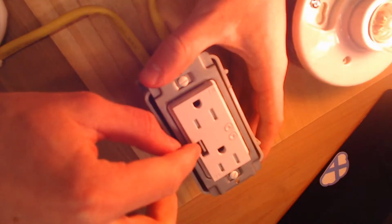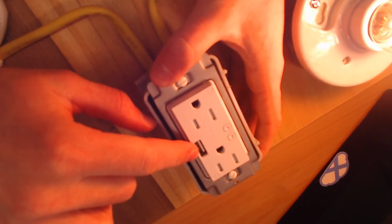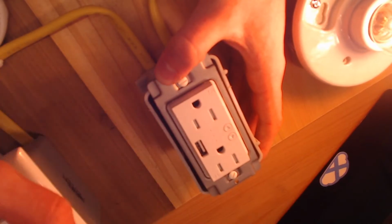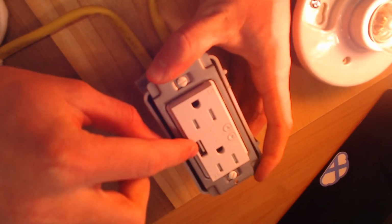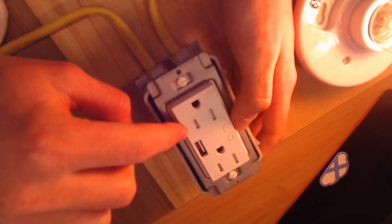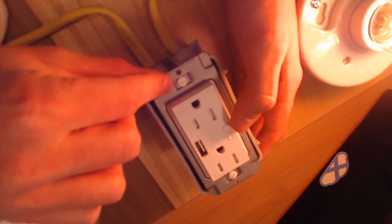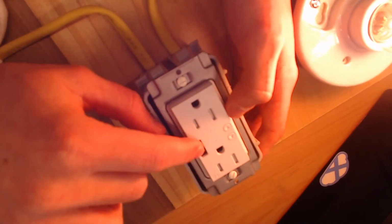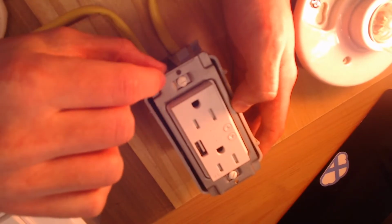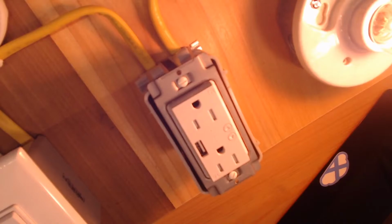There is not a button to control the USB port. There is actually a MOSFET inside turning the USB port on and off that you can use from inside of Tasmota, but it's not configured to any buttons by default. I would imagine it's not too difficult to make one of the buttons a double press to switch the USB port, but I've not played with that just yet. So that's something else that's coming. Let's see, what else do we have in the works?